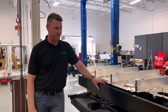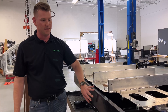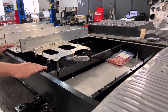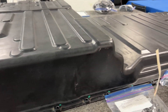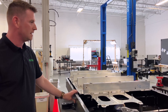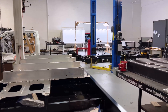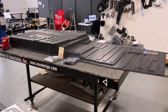A fuel tank, even at current gas prices when filled, is not $20,000 — there's a lot to be said for protecting a very high-cost piece like this battery. I would expect things to change moving forward, more specifically potentially with the top cover itself. As there's some comfort with the module's performance over a longer life period, maybe they go to a bonded strategy using an RTV sealer to clamp down on potentially an SMC, depending on how the volume goes with this vehicle. That is a very large part requiring a very large tool, and there are not many places in the region that can do that. At Munro, I've looked into a series of SMC strategies for other customers in different parts of the EV space — there are a lot of benefits of SMC, but some limitations from the availability of capital equipment to support it.